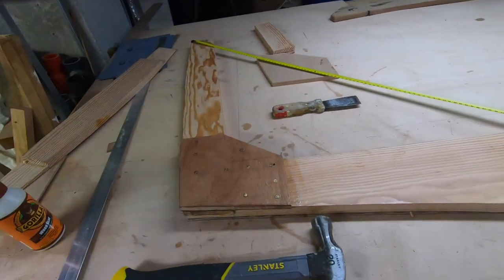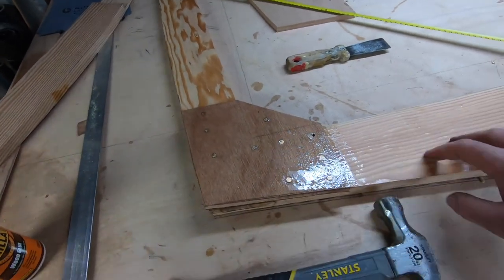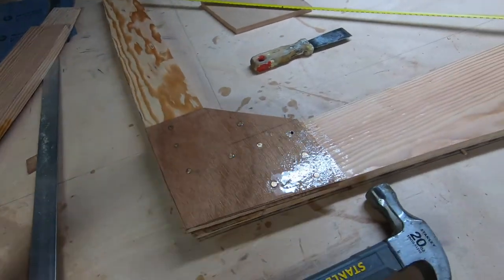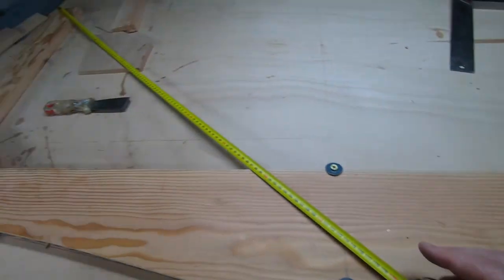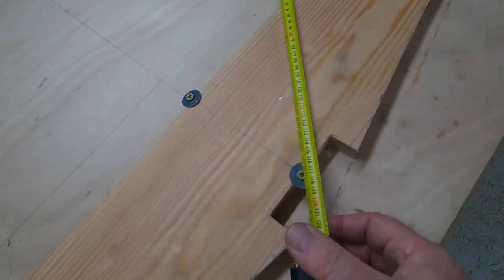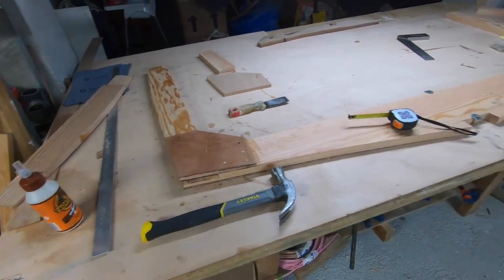I've just glued up frame number three on one side. I tried securing a screw in that top lug to hold it down while you put the nails in and this reinforcement piece to hold it all together. I've deliberately cut it a couple of millimetres wide because I can use my sander to sand that back off. By putting screws in here to hold it down, the proof of the pudding was when I checked the tape — it's 117.5mm to that corner, and doing it to the other corner it's bang on to the millimetre: 117.5mm. I've not achieved that accuracy with the other frames. This one is spot on. That's what you've got to do — hold the frame down before you glue it.